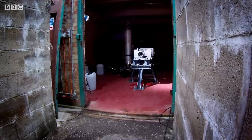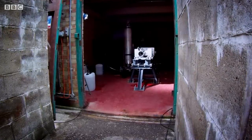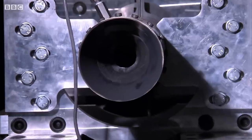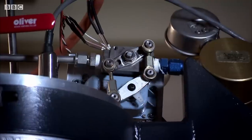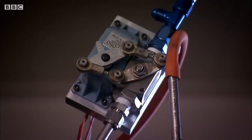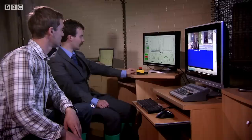The rocket's bolted firmly in place — we don't want it flying anywhere in this test. To succeed, we want spontaneous ignition, 100% burn in around 10 seconds, producing at least 2,000 pounds of thrust. Close the vent. Vent is closed. Pressurise the tank. OK folks, we're about 15 seconds away. Start the countdown.